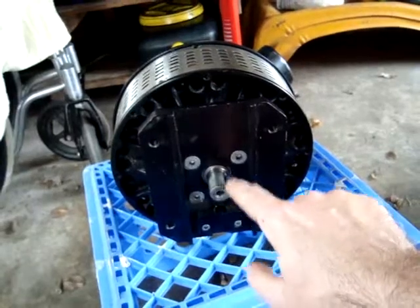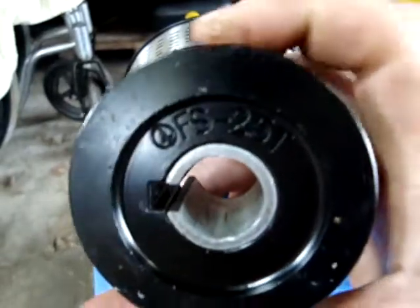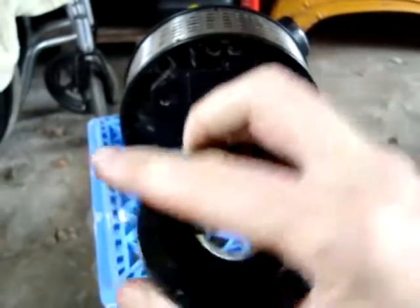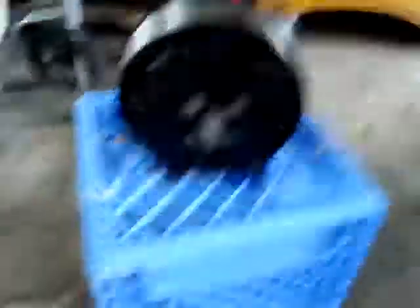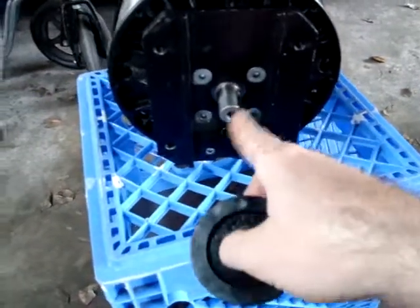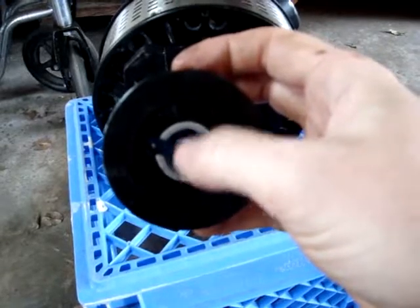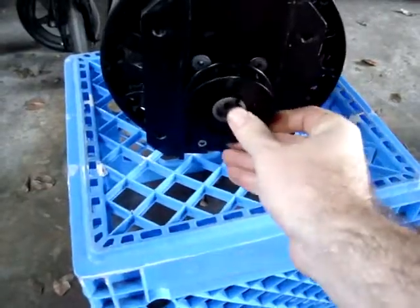So the next step was: where do you find a 25-tooth pulley? I got one here — you see this one stamped 25T. The silver ring in the middle, I added that; it didn't originally come with this. The problem is this shaft on the motor is three-fourths of an inch diameter, and the old pulley has a hole that is three-fourths of an inch, so everything fits perfectly. But the new pulley has an inner hole that is one inch because the newer motors apparently have a one-inch shaft. So I put this metal sleeve in there, which has an inner diameter of three-fourths of an inch and an outer diameter of one inch, so it tightens everything up snug.